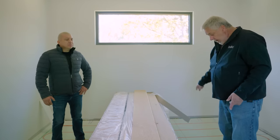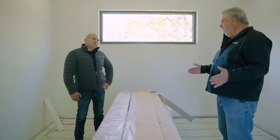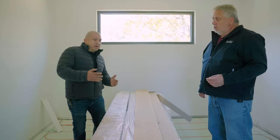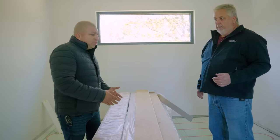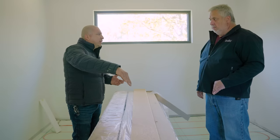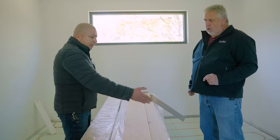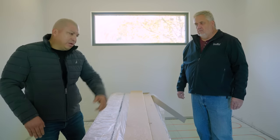In this floor, our floor joists are running left to right. Normally, if the joists run front to back, I recommend going the opposite way. But in this case, we have the radiant heat, so the best way is perpendicular to the tubing — we've got to take the time to make sure we don't hit any of those. I'd recommend going the opposite way of the radiant heat runs.